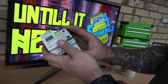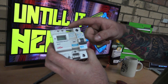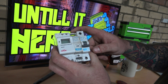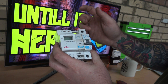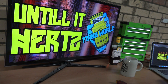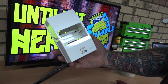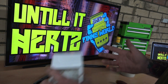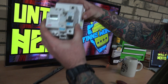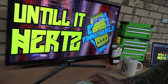Then I'm going to put another breaker after it. The feed to the timer is already protected in the board — I'm going to run that feed through here and out. Should be simple enough. I've got a very old board built back in the 80s and I can just fit another enclosure in there, so as opposed to rewiring the whole board — voila, should fit, should be easy. We'll see how it goes.